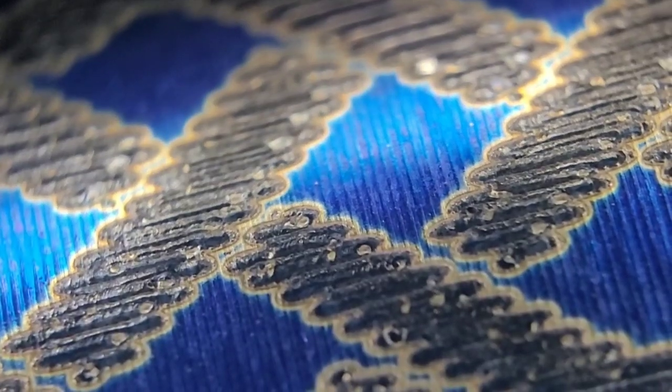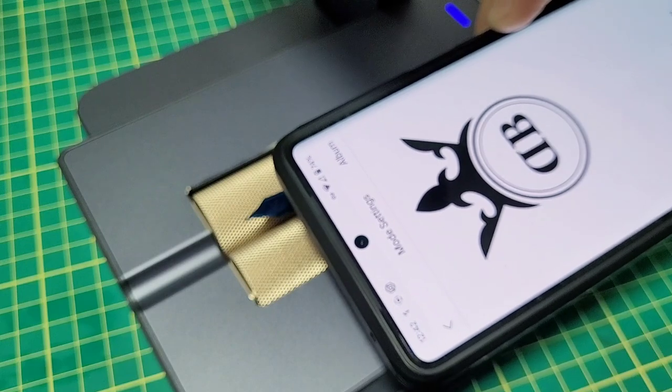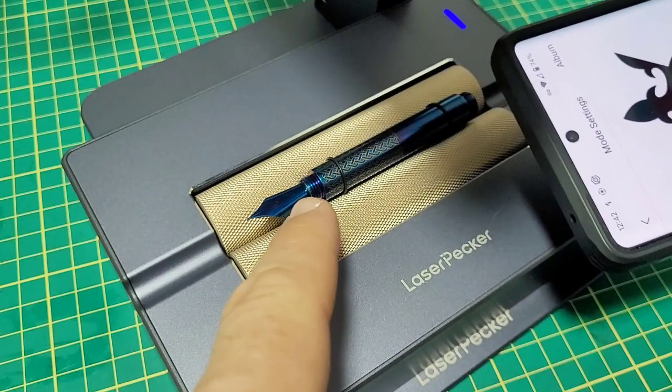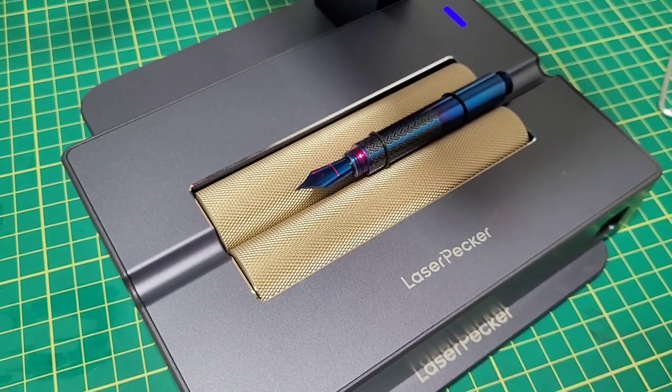You can see just how crisp it is, and you can see the banding between each laser pass. I probably went too high on that pass since all you want to do is remove the layer — and that's exactly what this did. It's just absolutely gorgeous, and you can't really see it with the naked eye; you need 20× magnification. Had I known I'd have this laser, I would have done it this way first. I've always wanted to put my logo onto a pen nib. The frame feature in the app lets you slide around with your finger to position exactly where it's going to land.